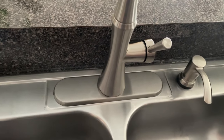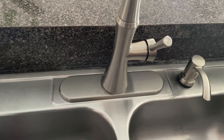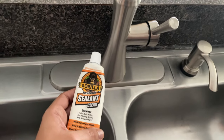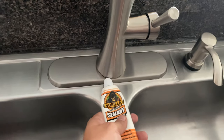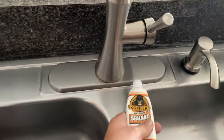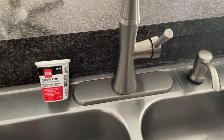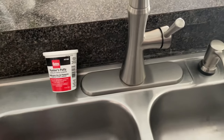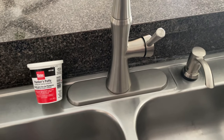There are two ways for sealing this plate. The first one is the easiest and you will have to use 100% silicone clear caulk. You will just apply it throughout the entire edge of the plate to make a good seal. Although this is the easiest method, it can be sometimes messy. The second method involves using plumber's putty. Although this method requires more work, it is the cleanest and most aesthetic in my opinion.